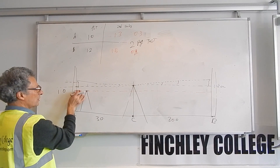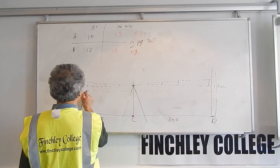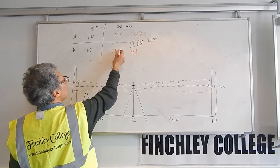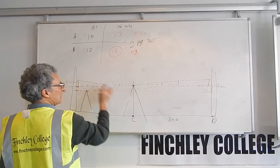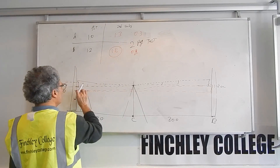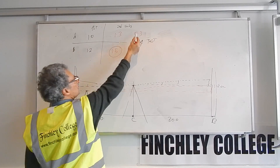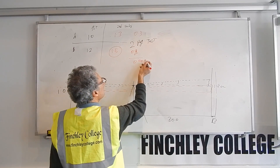When I set up close to A, there is virtually no error at A — just a tiny error — so any maximum error would appear at B. But because the difference between the first set of readings and the second set are the same, there is no error in the instrument. Therefore 0.3 minus 0.3 equals zero — no error.